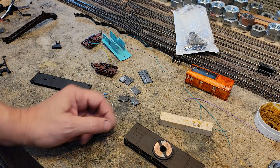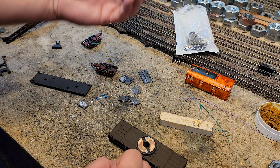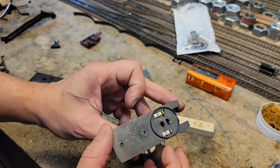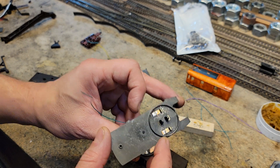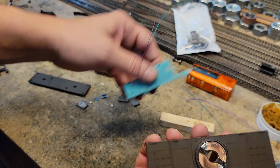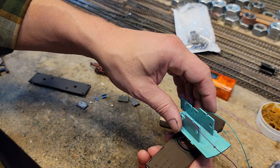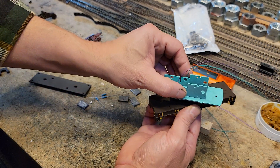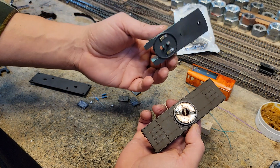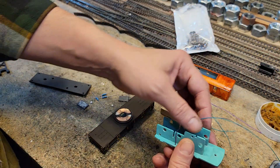Then, because one side is red rail and one side is black rail, I cut out a strip across the middle. On the bottom here I've got two wipers glued on — old pieces from some old motor. I could have used copper strip, but these fit just right. Each one of them will sit on part of the copper sheet — one will be here, one will be there. If you rotate around, they will cross over, so they don't short. And if you rotate it just a little bit the other way, they'll be in the gap and the lights will shut off. That is not an original idea — that is the way an Atlas turntable works, and it's how our Colossus 1 turntable works.